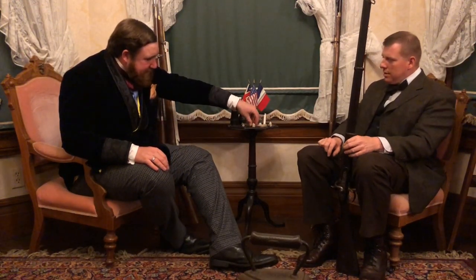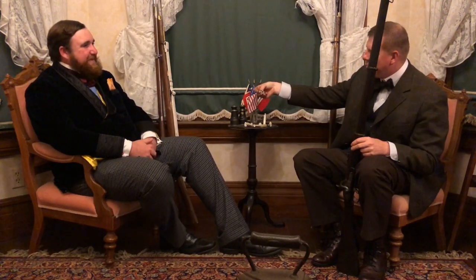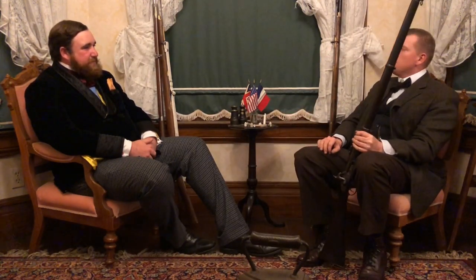The P51 was a copy of the French Minié rifle, .702 caliber, so you could in a pinch shoot .69 caliber Brown Bess ammunition — though after a couple of shots the .702 barrel fouled quickly anyway. Then the P53 — known as a 'small bore' at .577 caliber — represented a profound difference. Going from .702 down to .577 meant the soldier could carry so much more ammunition. The smaller bore was more accurate, they went from four-groove to three-groove rifling, and it's remarkable how early the Pattern 1853 was produced.